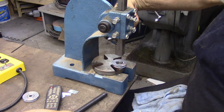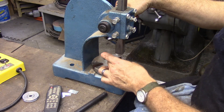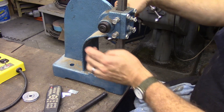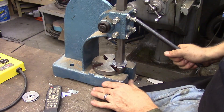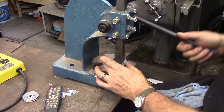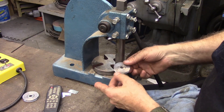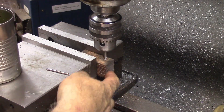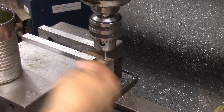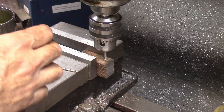I'm going to press in these bearings — these are what they use for roller blades and skateboards. I'm making five of these, so I've got 10 straps clamped in the vise. I've got a piece of aluminum rod on one side to tighten them up, and I'm going to drill them all at one time.